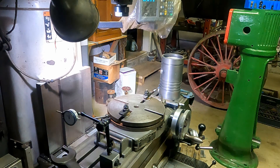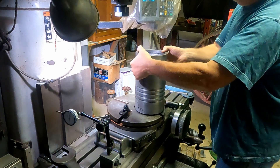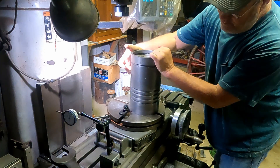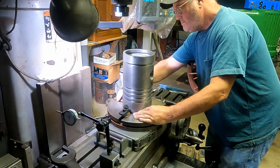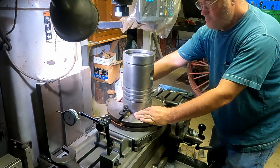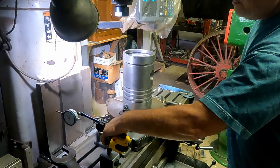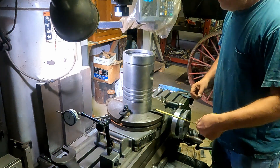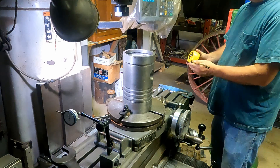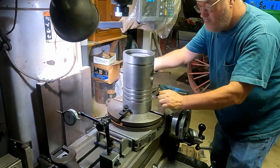Back on the bridge port for the oil groove feature. This is what oils the wrist pin bosses and bushings that we made — a very important feature. Just going to get it kind of centered up here on the rotary table and then we'll be ready to start machining. Using a couple stops and a tape measure for rough alignment: 12-inch table, 6-inch piston, should be 3 inches all the way around for spacing. That'll get us close, then we'll use a dial indicator to dial it in.